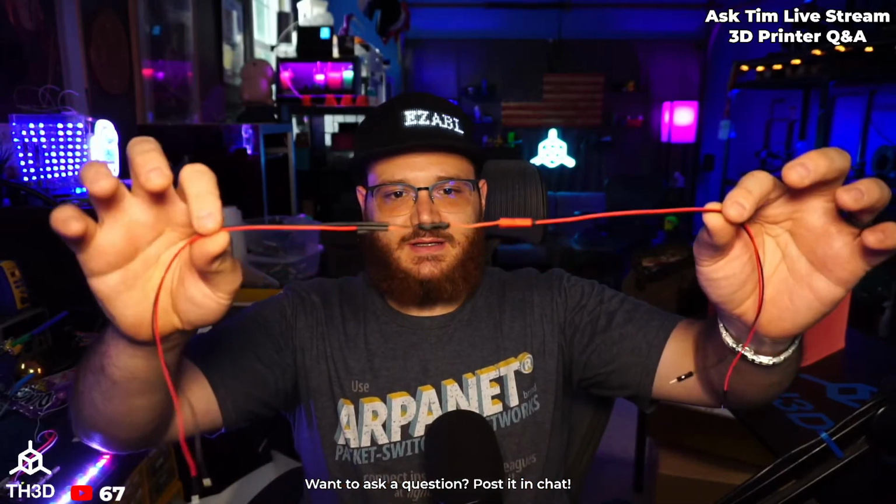It's this tiny little guy right in here, for the, oh god, I tangled it. Hang on. I need to untangle my wires here. So I am going to record a video on this, but this is a little tiny step down. You put your 12 to 24 volts in here, and then you get 5 volts out. So these go right into the 3-pin JST. There are guides on this already, and I got to touch base with the team, but I should be able to stock that stuff tomorrow. So, a nice little compact 5-volt step down that'll work great with these.